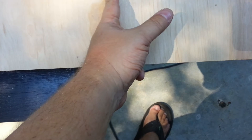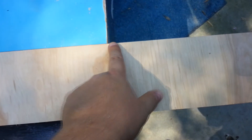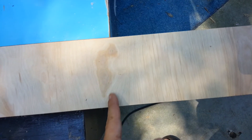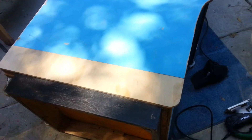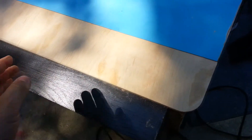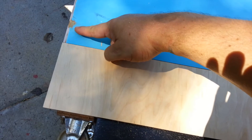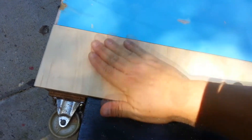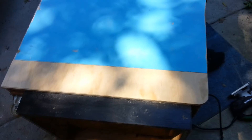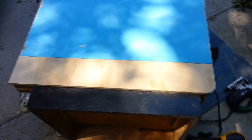The Nintendo cabinet comes at a little angle around the front, so I'll cut to the outermost point and continue that angle down. I went ahead and traced out the rest of the cabinet profile from one of my other finished Nintendo cabinets to get the correct angle. Once I Bondo this, you won't even see that edge anymore - I'll fade it from about right here, bring it down nice and smooth, then lots of primer and it will look amazing. That's how you restore the side of a beat-up Nintendo cabinet.